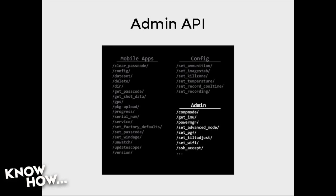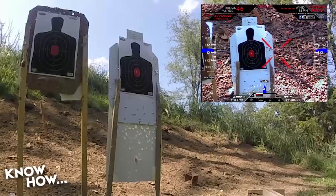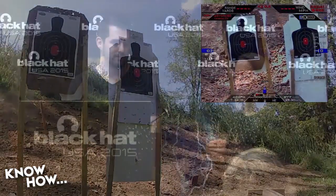Given that this device is kind of the first of its kind, really, you could very much tell in the hardware where they were kind of going all in, because there was no lessons learned from somebody else. They were learning the lessons from the start. So everything's very well silk screened. So you pull it open and say, oh, TX RX, and I bet that's a UART plug-in, and there it was. But that said, it was all password protected, so that still wasn't good enough. We still had to tear it apart to get actually into it. We had to actually connect to the chip that has the file system and then to our computer to actually get to the file system.